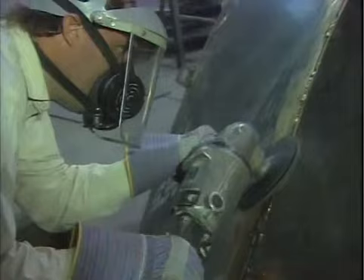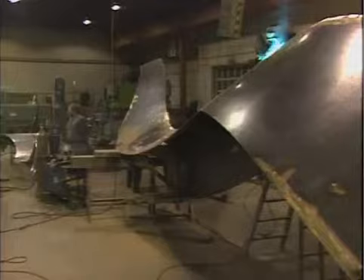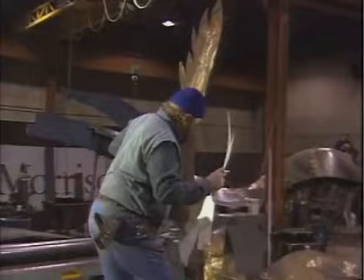Once the piece is in position, it is tack welded into place. Each seam is welded shut and then the welds are ground down to conform with the final edge that John requires. When all these segments are on, I can stand away and overview it and make sure that beautiful, landscape-esque, very female form is the way I want it. Does it have the right attitude? Is it projecting the right sense of poise? I want it to appear as though it's just landed or maybe just taking off — and that's a very precarious kind of situation for 15 tons of bronze.